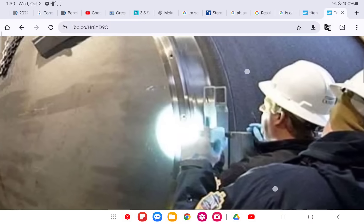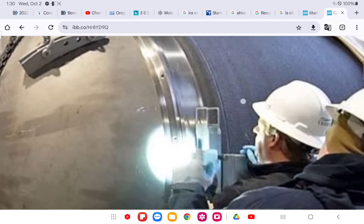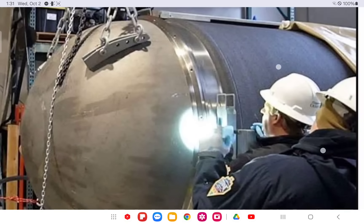It's on the outside when the interface ring is there. The implosion won't push it — something else has to push it and give it force. When I say the back fell off, maybe that would be enough to fall forward and shear it off and buckle that rail. I also have to leave open the option that they were going nose down and this couldn't hold the weight nose down, and it sheared the weld off. I'll show you what the weld missing looks like — so it is the weld that failed.